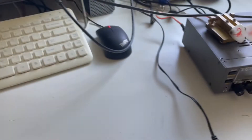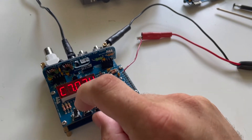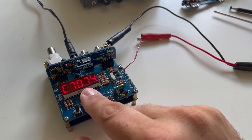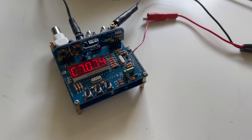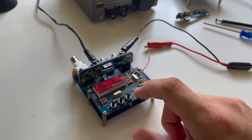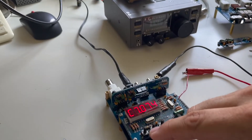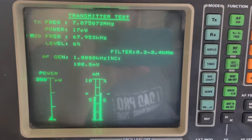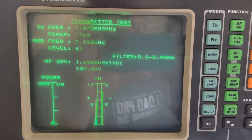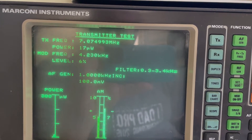What I need to do is dial this down. I need to double-check the manual because these buttons didn't seem to be doing anything. Okay, so I was doing the right thing — I was just expecting a readout on the screen. Since I need to go down, this middle button is tune down. As I tune down, the frequency is dropping in very fine increments. Because I need to drop down by a whole kilohertz, there's going to be a lot of tapping here.